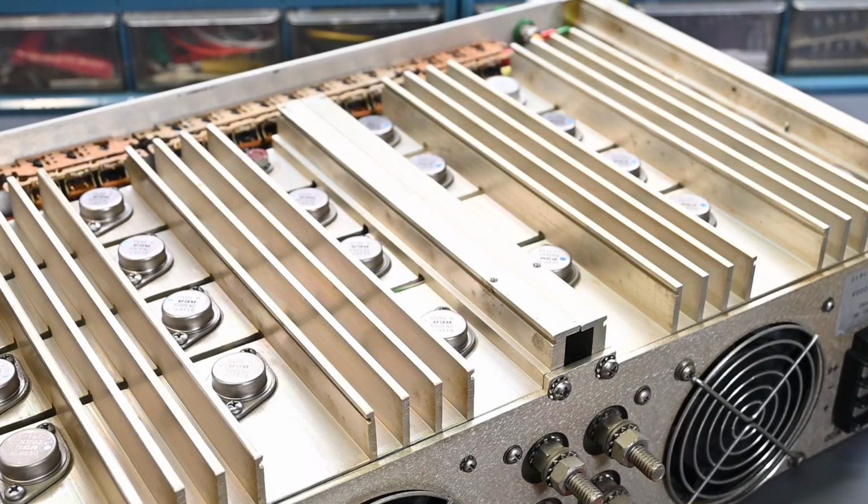Just compare that to that DLP 130-15750A Dynaload that I have. That has some very unusual TRW transistors, and I have a TRW data book from back in the day, and it doesn't even list the model of transistor that other Dynaload uses. So sometimes TDI did use some very unusual components. I think they were custom made and custom spec'd for the application, but in this case the 2N3055, super common and easy to obtain.